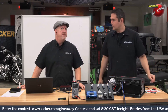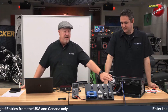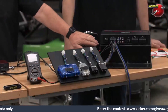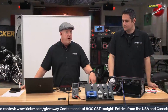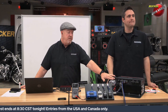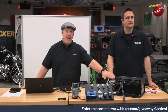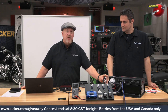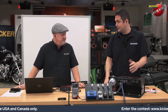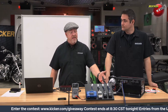Almost every single head unit on the market now has a heat sink — even this one right here. The case itself is a heat sink and it's warm. What happens inside rather than having a true preamp — which is actually the best way to get signal into an amplifier — is these aftermarket head units have a line output converter built in. They take the power coming out of the internal amplifier, bleed it off as heat, connect the signal to the center pin of the RCA, and tie the shield to chassis ground. So they give you a low-voltage output.